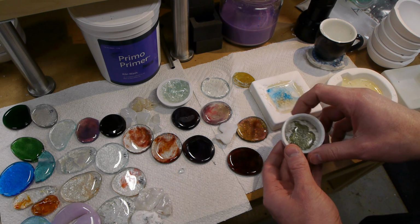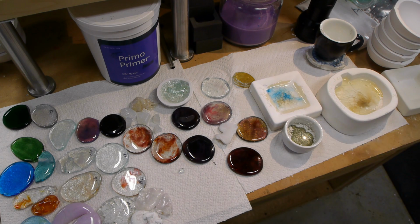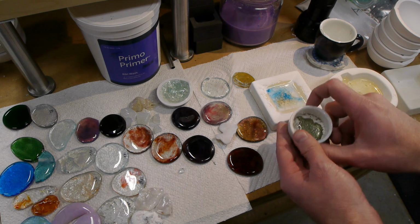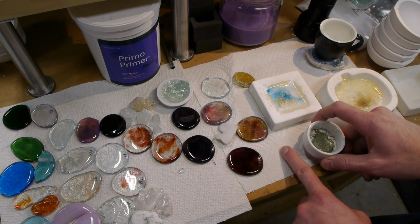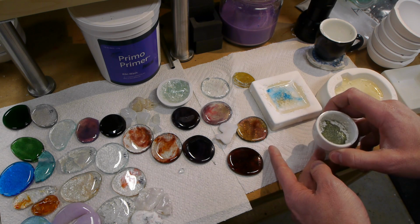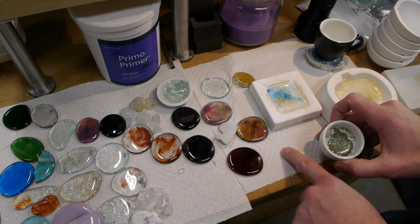So needless to say, this is getting to be kind of difficult to do in the home shop, having molten tin with hydrogen gas and everything. And then another interesting problem, if you're making photochromic glass, for example, you can't do it in the float glass process because this glass is very sensitive to the environment it's in.